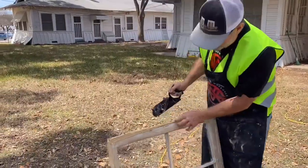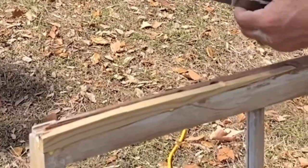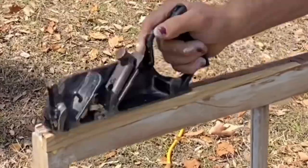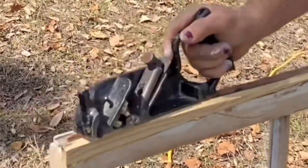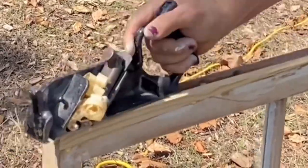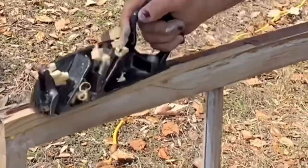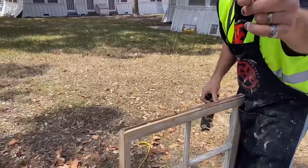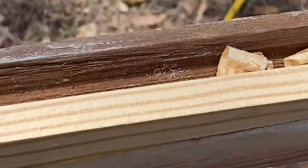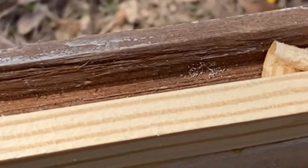I'm going to go this way now. Didn't want to go that way, so I'm going to change the gap on my blade a little. Let me show you something — can you come in and get a close-up and look at those chatter marks? Those little breaking, those broken pieces, those little defects — I don't know what you call those, but that's called chatter.